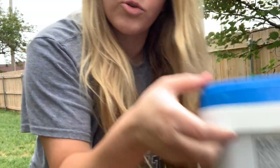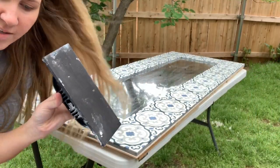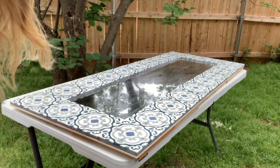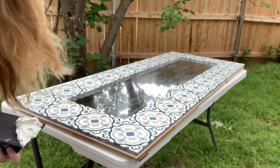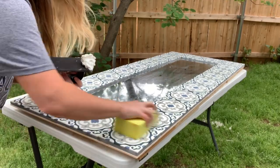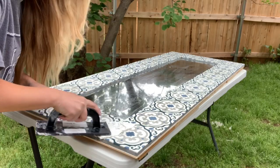It's been 48 hours so I'm going to go ahead and lay the grout onto the gaps of my tiles. I have a sponge, a bucket of water, my grout, and I'm also grabbing some paper towels. Make sure you're working in small sections — do a little bit at a time and wipe off the excess grout on top as you go; it'll make it a lot easier. I have my rubber grout float to apply the grout. I'm getting a small amount on the float and I'm taking my damp sponge first to get the tiles slightly damp so the grout wipes off even easier.